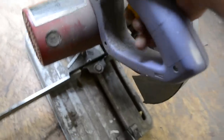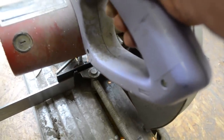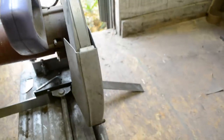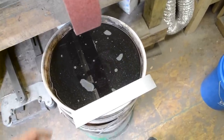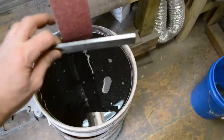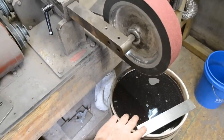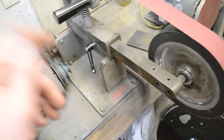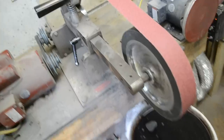Alright, chop off a piece. So next what we're going to do is go ahead and grind a profile. This is a cool low budget method because you can just chop your blank out and then use the grinder to get it how you want. I'm going to start profiling — I have a little mark on there so I know how far to grind ahead from my handle. I've got the grinder at full speed. Use a 40 to 60 grit belt to go ahead and grind your profile.